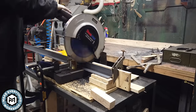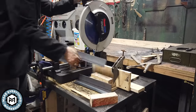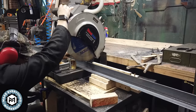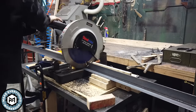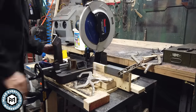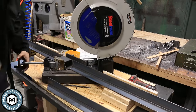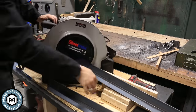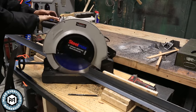This project starts off with a considerable amount of time on the metal cutting saw. Most of this is going to be made out of two by two by eighth inch angle, with a couple of other different types of material along the way. For the most part I'm cutting and mitering this two by two angle. A big part of making money doing work like this is having the proper tools to cut your material up efficiently.